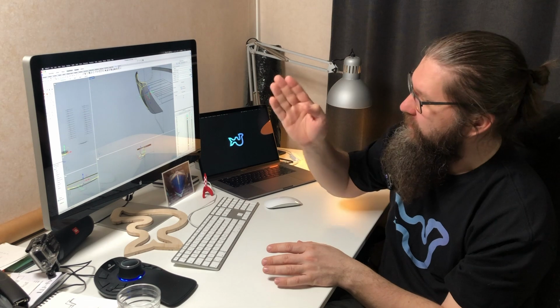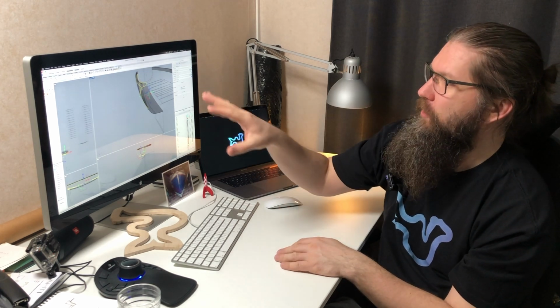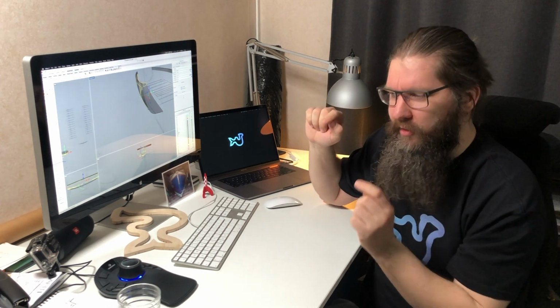The first problem is that this CAD program tends to make straight lines from the curve. So it just chops the curve into very small straight lines, and that's not the way I want to do it. With a little bit of googling and a little bit of fiddling, I managed to find commands that make those lines as arcs from a circle, and that's important because the CNC router understands only straight lines and portions of a circle. There is no such thing as a compound curve or anything like that. They are just parts of a circle or straight lines that the machine actually cuts.